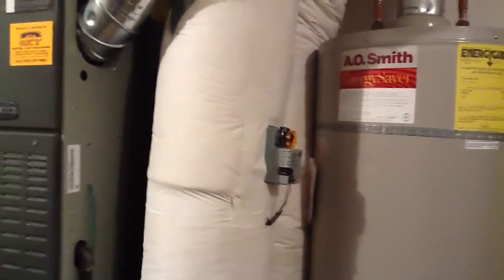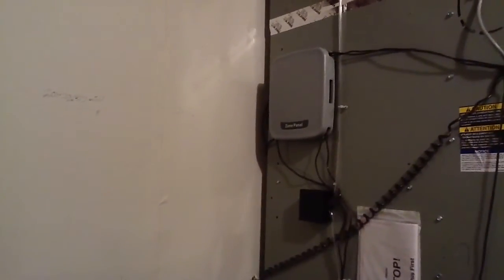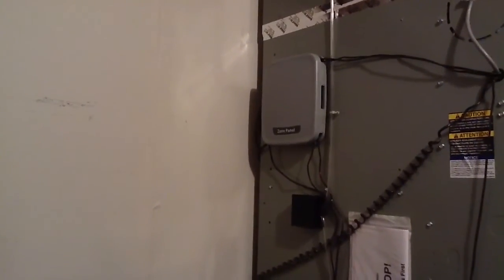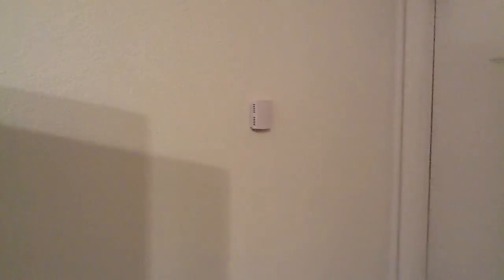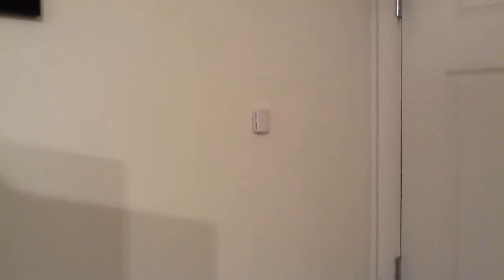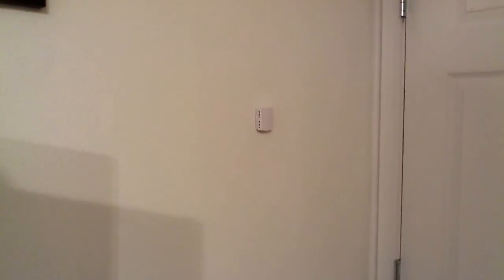They're all connected up so that I have three zones — two zones upstairs and one zone downstairs. That all gets connected through here, and the zone panel based on temperatures ends up controlling which dampers are open and which ones aren't. In each zone you have a temperature sensor. There's one in one of the upstairs zones and an identical one in a second zone. Downstairs the thermostat acts as the temperature sensor, so that the zones can all be individually temperature controlled.